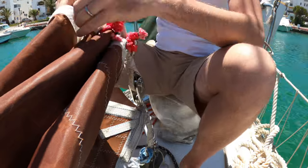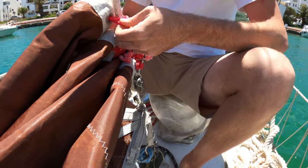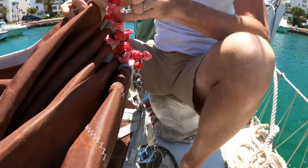You might be wondering if the soft shackles can get damaged — yes, just like all hanks can wear out, you have to inspect them and make sure they're still in good shape. But being dyneema on dyneema, it's not too much of an issue with chafe. The dyneema headstay is actually covered in a chafe sleeve made from dyneema, so you have dyneema on dyneema on dyneema — just keep an eye on it.